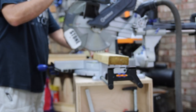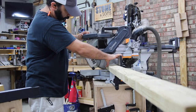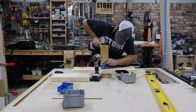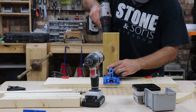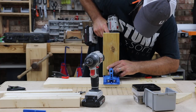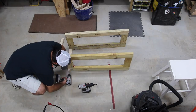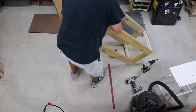Now I'm going to move on to the ball bin. I'm going to take a few pieces of treated lumber and create a couple of different frames. These short pieces that I'm putting pocket holes in are going to connect a couple of longer pieces — these are going to be my sides. With pocket holes I don't have to have any overlapping joints or face-to-face joints. So with pocket holes I can build it in this orientation and it takes up less space. I'm going to do two of these and connect them with four two-by-twos, just screwing a couple of screws in from each end.